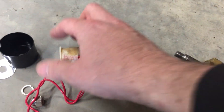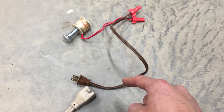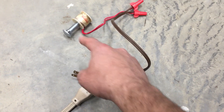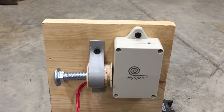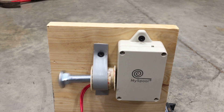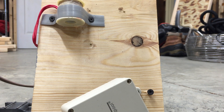I picked up this little solenoid for five bucks. We'll unscrew this and take the lid off, take the valve out, and really all we want is this electromagnet. We use wire nuts to attach it to an old lamp cord and put a bolt in there that gets pulled over when we plug it in. We can configure it like this to get a text when the power comes on. Here we're set up to test for power failure — when we lose power, we get a text.